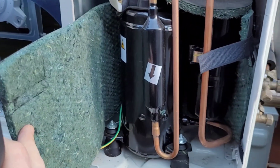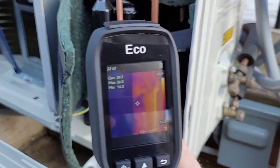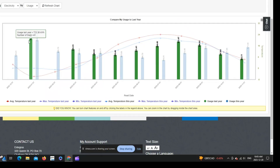You don't want the oil and refrigerant mixing in the compressor. At colder temperatures they will mix — the refrigerant will migrate to the compressor — and on startup you really don't want these things pushing liquid refrigerant through the compressor. When you see a manufacturer recommend keeping it powered up at all times, that generally means they want that crankcase at a certain temperature. So if you are fully off-grid, that's something to consider: this thing will be eating up some power at all times if it's powered up.